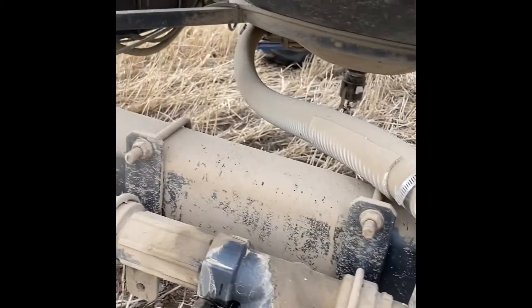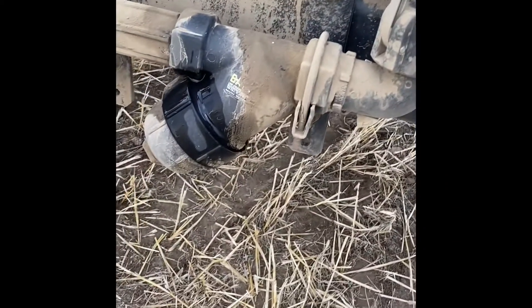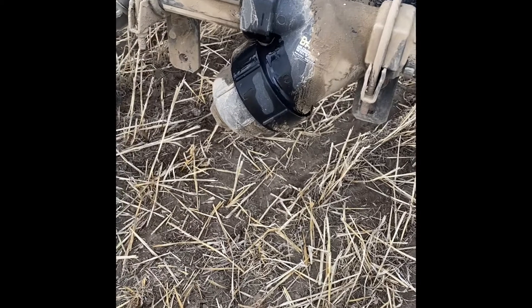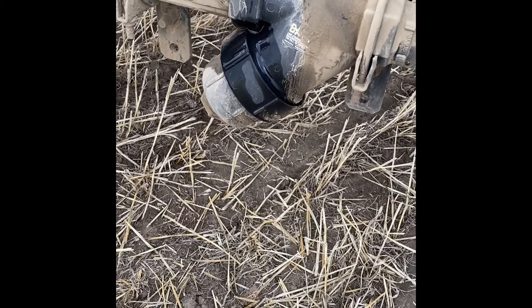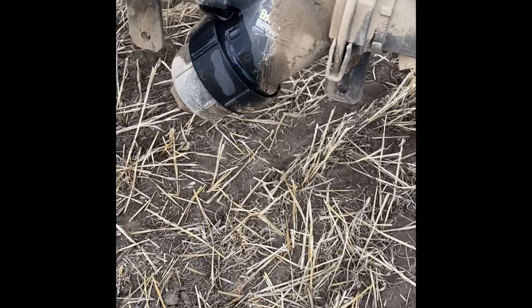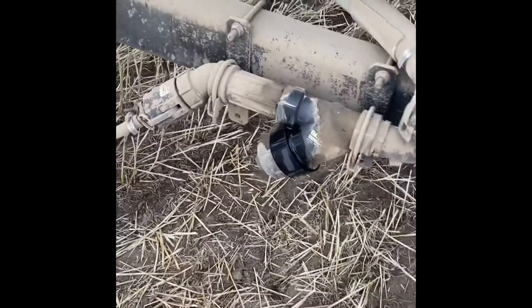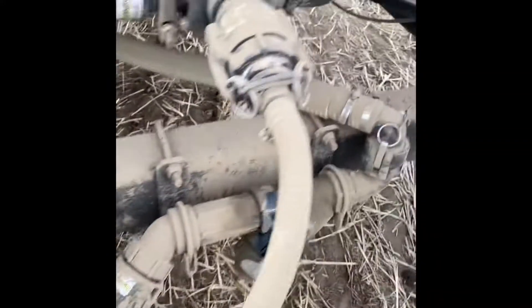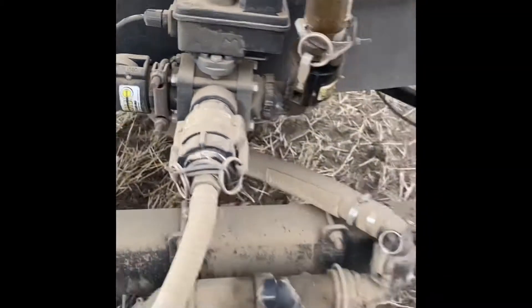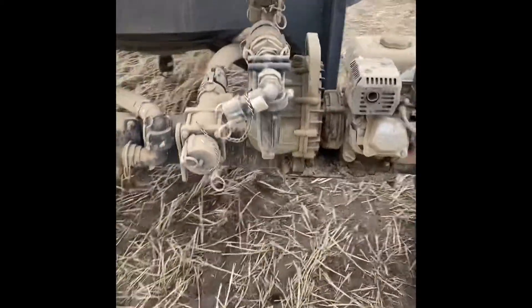As you can see, we have a feed off the bottom of the tank coming off a two-inch line into a two-inch 80-mesh strainer - that's about as fine as we could go without slugging this all the time with the extract. It doesn't seem to be plugging the metering tubes. That feeds up into the pump, which then feeds into a three-way valve that either bypasses up into the top of the tank or feeds straight ahead into the drill.